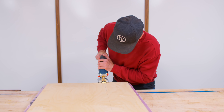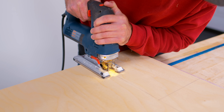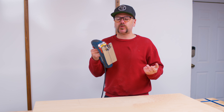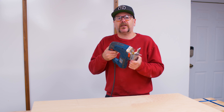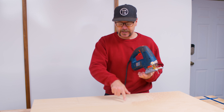Don't force it. Another quick tip: don't grip the jigsaw really tight. A lot of times when you're using a tool for the first time or you're new to a tool, you'll tense up and get a firm grip. You want a safe grip, but you also want to keep loose so you can let the jigsaw do the work and control it down a straight line.